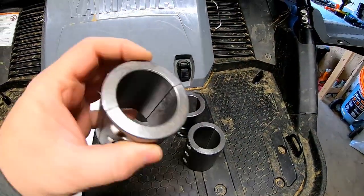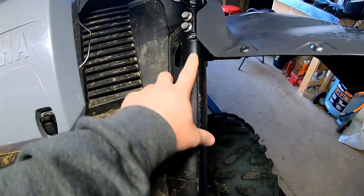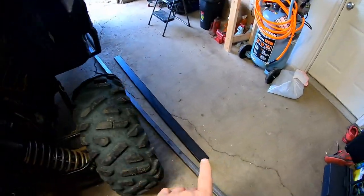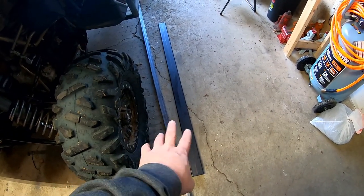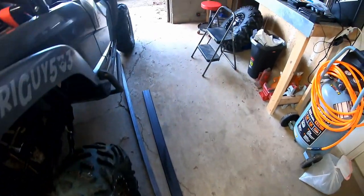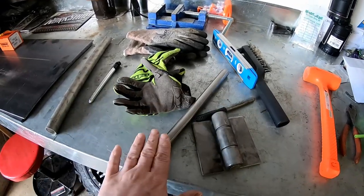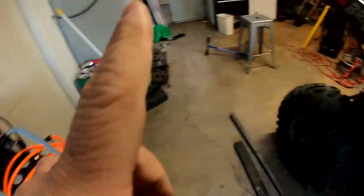So this is what we're working with. I bought these collars off of eBay for like $70 for the four of them. What those will do is they'll clamp to the frame here, and those will be the base for the actual mount of the spare tire. I'm working with 3x1 tubing, some inch-and-a-half by inch-and-a-half square tubing. I'm using square because I don't have a tubing bender. I also have some 3-16ths plate and some miscellaneous pipe, maybe this hinge, and I think this is like 5-8th or 3-quarter inch rod.